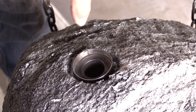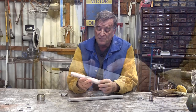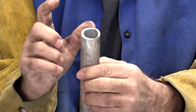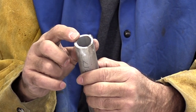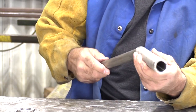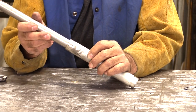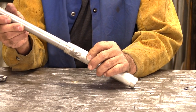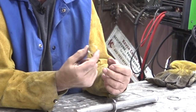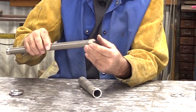But what the heck's down inside there? So this is the other half of the whole bearing equation, what's buried in the top rock, if you will. It's a piece of 304 stainless pipe — one and a quarter inch diameter, a heavy wall, nice thick wall on it. The only problem is the inside diameter of this pipe is a little bit bigger than the outside diameter of the rod. You can see just a little bit of wiggle inside that pipe. That rod's going to wobble around inside there just a little bit. So I had to get crafty with it. I wound up making myself a little bushing that will just slip down inside and fit on this shaft, and that helps take all the slop out so it doesn't wobble around inside.